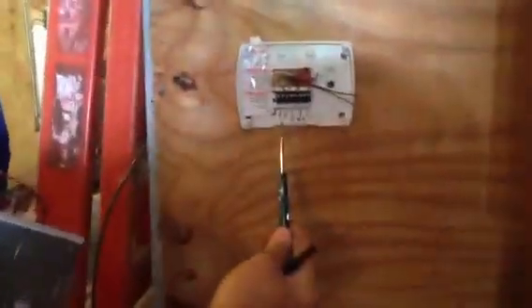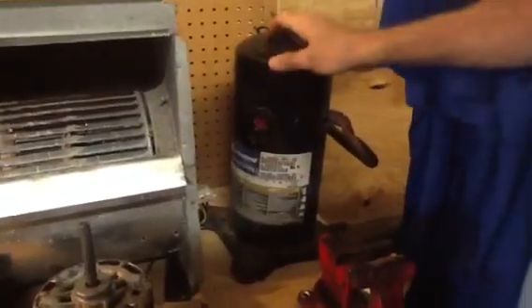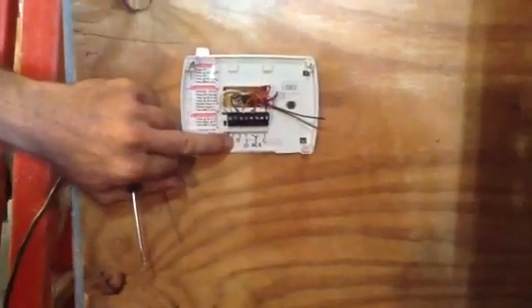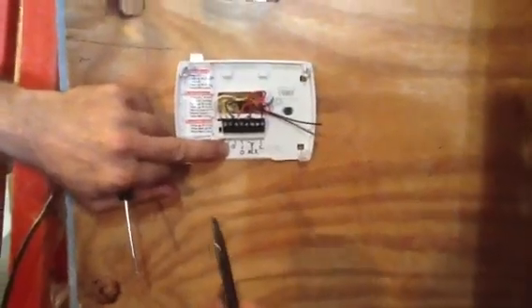When I say W heat strip, that's your heat strip — that's what that W wire, when you turn it on, it's going to energize this part right here. Yellow is compressor — the yellow wire turns on this part right here, this is the compressor. G — that's green, that's blower. Your indoor blower has to move air across the evaporator, because if it's not moving the air across the evaporator, it's going to freeze.